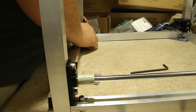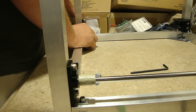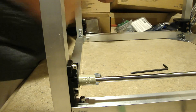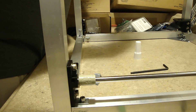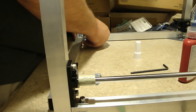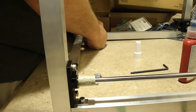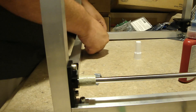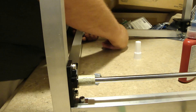Okay, I'm back and I'm going to be putting the last bits of screws in here. One thing to keep in mind is don't just mark all your holes and start drilling without putting things together because things might change. I like to work at it slowly just so I know everything's going to go together. I've had this part here together about six times now just to make sure all the holes are going to be in the right spot - I'd drill a couple of holes, put stuff together, drill a couple more holes, just to make sure all the brackets would be fitting in the right spot. I didn't want to have all the holes drilled and then be just a tiny bit off. So I'd just put some of these bolts in, just not tighten them all the way. Almost done here - just got a couple more bolts to put in, and then the whole top part of this frame will be done.